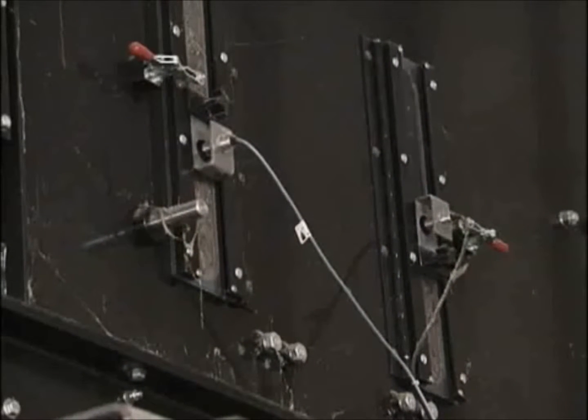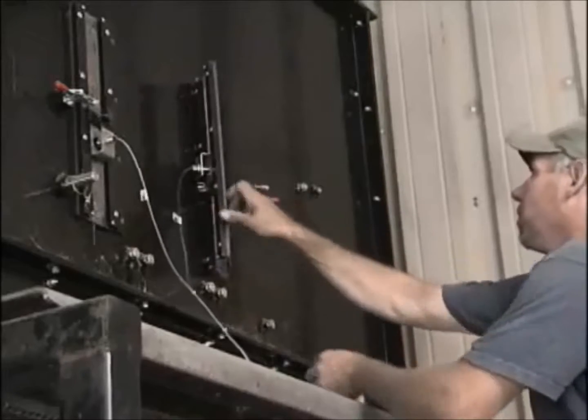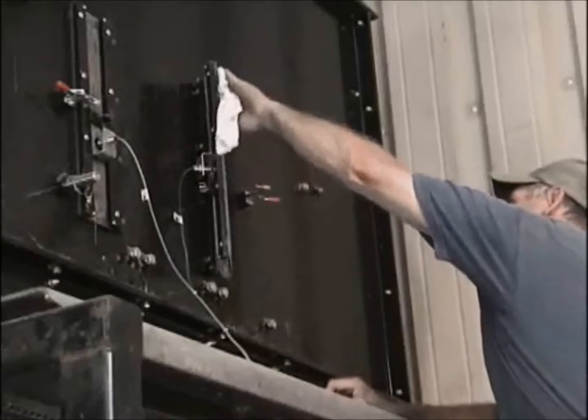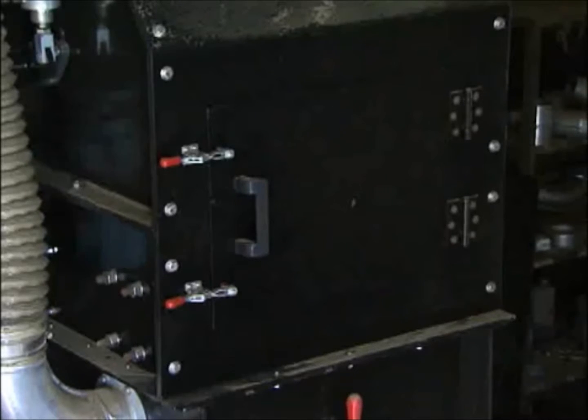Product level sensors for controlling in-feed devices such as bulk conveyors or live bottom feeding hoppers are mounted to one-quarter inch clear Lexan doors with quick-release clamps for easy access and cleaning. All bearings are easily accessible for routine greasing or maintenance. Multiple access doors in the top, rear, and front of the 300VF make it easy to clean and maintain.